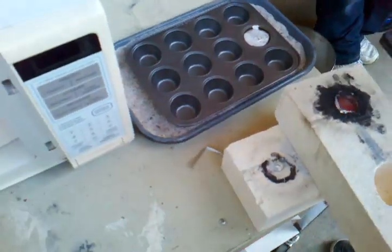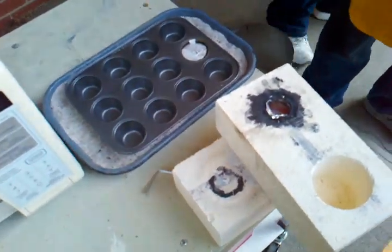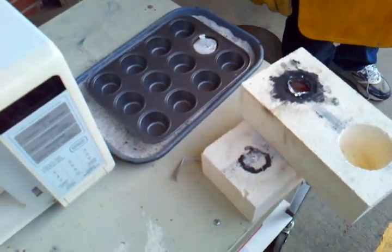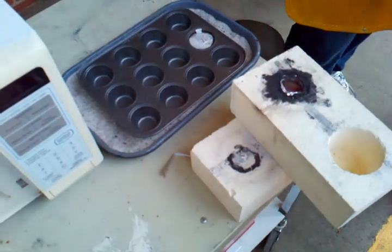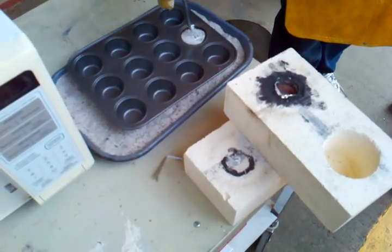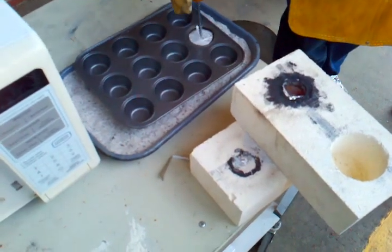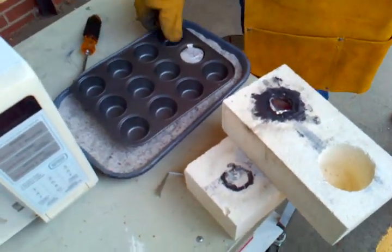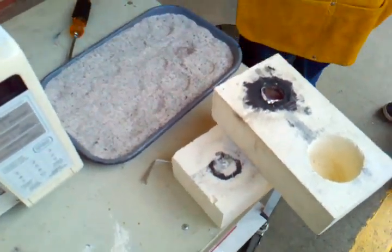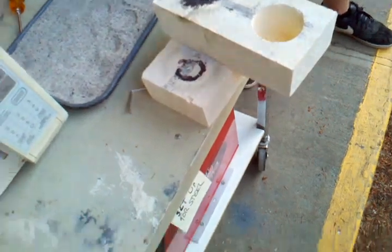This is gonna stay hot for quite some time. It'll need a while to cool. Grab me a screwdriver or something. I want to see if it's still liquid. If it's not we can spray water on it and stuff — but if it's liquid and you spray water on it, it could be very bad. I can't tell if it's liquid on the inside. This is probably set now. Tap it and see what it sounds like. That's probably solid. It's solid on the outside, melted on the inside — that happens. And you cut it open and it goes everywhere and you die. I'm gonna go run some water on this. Watch out for steam coming off in your face.